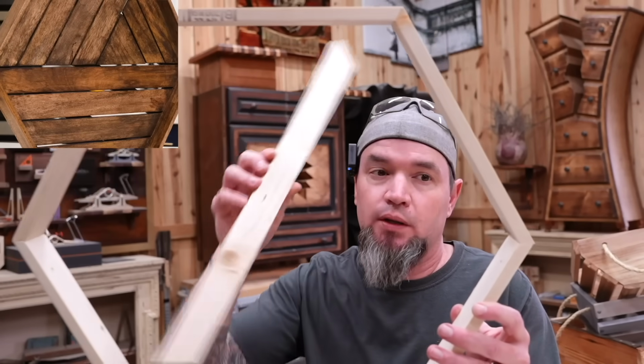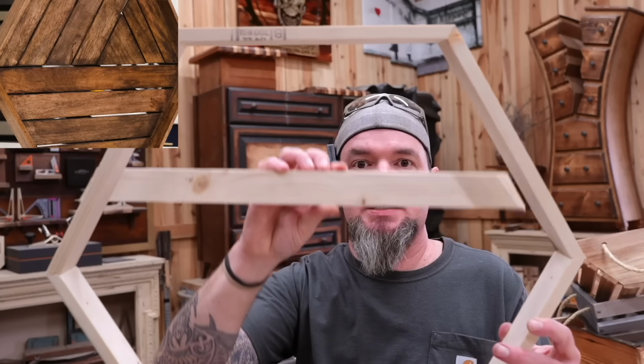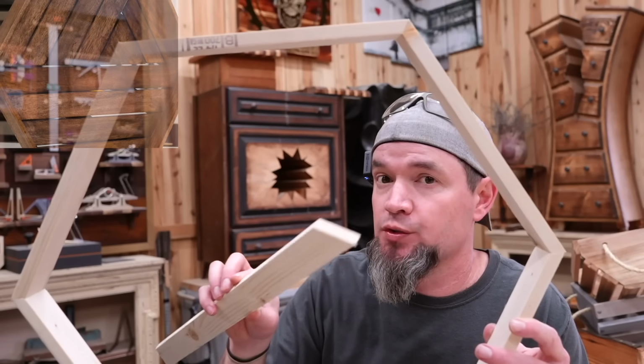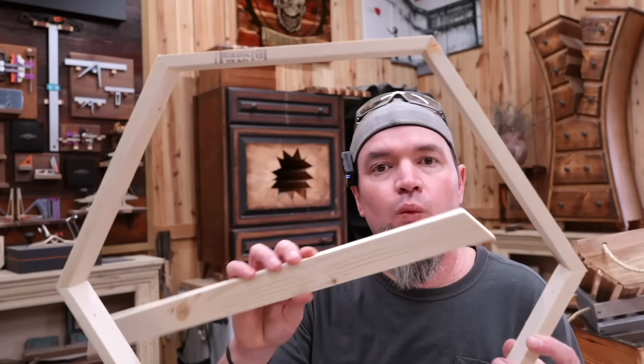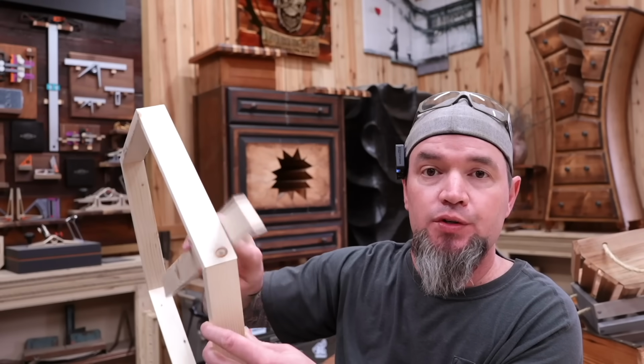I just cut this as well. Again, 30 degrees on each side. So they'll have slats like this in the back, and the only thing that they are there for is to be able to attach the ones that you'll see, or I'll call them the ones in the front. So once you have some back slats in and flush with what we would call the back of your tray, now it would be time to install the inside.